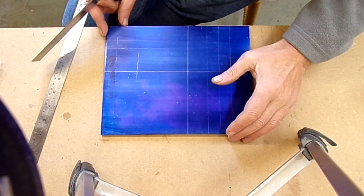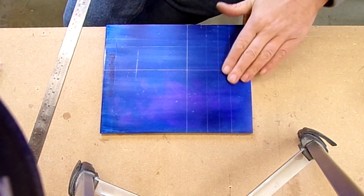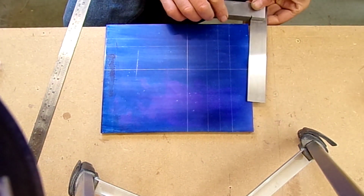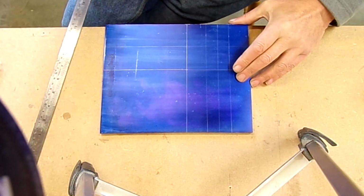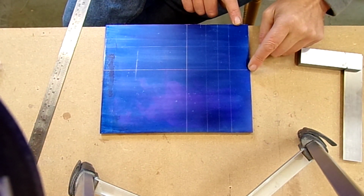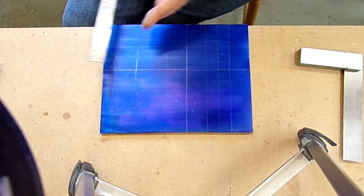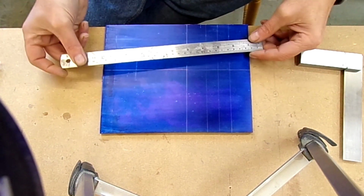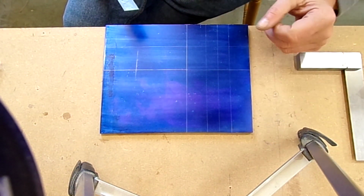Okay, let me explain where I'm at with this plate at the moment, or plates. A set of 3 need to be made. I'm marking out the first one at the moment. First stage was I've made this edge and this edge master edges, so that an engineer's square goes across, there's no gaps, make sure that's absolutely square to each other. And then what I've done is I've measured up this way the 3.5 inches there and at that end of the plate, because I'm going to be making 2 on this plane anyway. So going across, and then drawing. By doing it right the way across, you end up with the least error. So, you know, say it was 5 thou each end, it reduces the overall effect. It's averaged out quite a chunk.